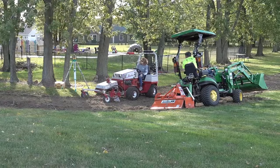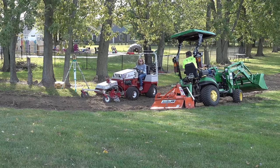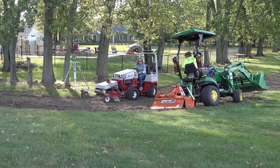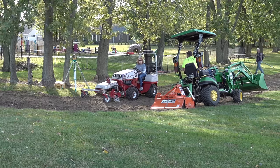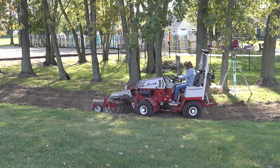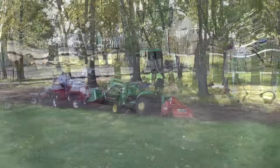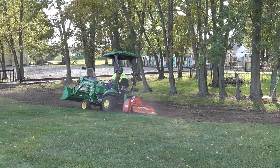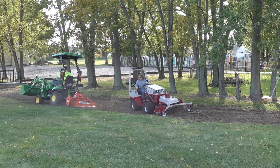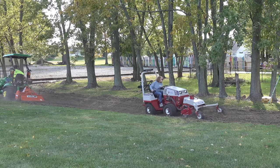You can run into and over those roots — you'll have to. Try to waller them down or else we have to saw them. You can get right down in here in what's going to be the trench and pull it up out of there. The power rake is not only tolerant of roots and rocks, it also helps you deal with them easier. You're going to see Christie run right up there and just get that root dug right out of there without any issue at all.